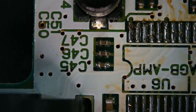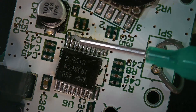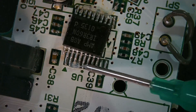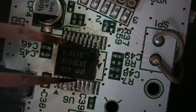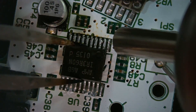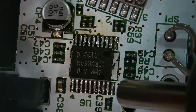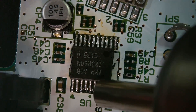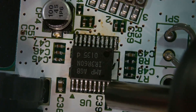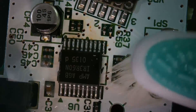With that problem taken care of, I'm going to clean up the area and pretend I'm replacing this chip with a fresh one — even though it's the exact same — I just want to see if we can reattach it as well as we removed it. We'll apply some new flux, and now I set the gun to 25 airflow, still at 400°C. After a few seconds when the solder starts flowing, I move the chip around until the position feels right, then back off with the tweezers and let the hot air do the rest. It was around 40 seconds in total until I removed the heat.